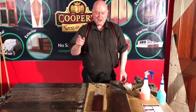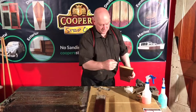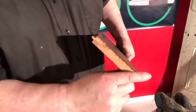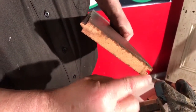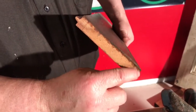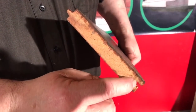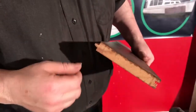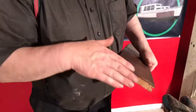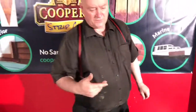Now, also, when you sand a floor, you think to yourself, I've got a lot of floor. I've got all this thickness here, but you haven't. You've actually only got that little bit there, down before the tongue, your tongue and groove. So you've got about 6-7 mil there, and every time you sand the floor, you sand down, down, down, and you reduce a lot of the integrity there. Now, if your floorboard is slightly bowed, it's not unusual. Again, you go into a place and the floor is slightly cupped, especially these wider planks, and the sander goes across and even sands more off there. So you do not want to sand a floor if you can help it.